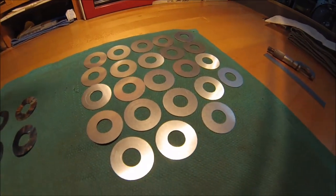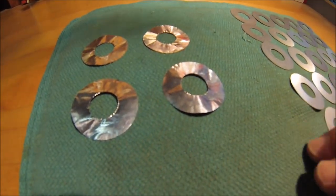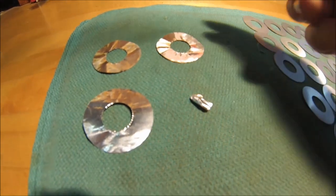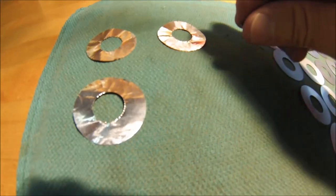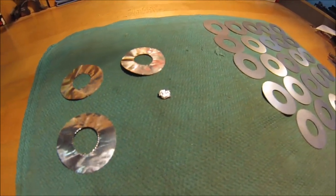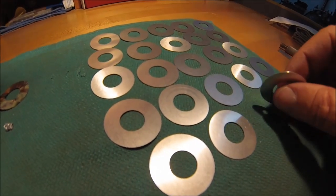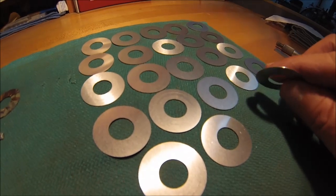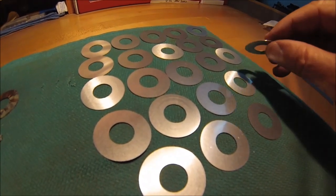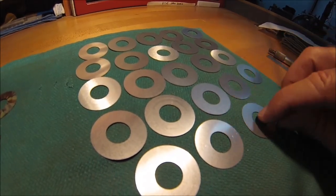Here is the yield: 23 washers, 8-thousandths of an inch thick. And the tin foil ones actually did survive, even though they got wrinkled up — you can stretch them out. This material is ridiculously delicate. To make a machined washer out of material that soft — that is not a bad trick. You can do this with plastic, steel, and naturally steel is going to require more patience and more pressure, but it can be done. It does yield a really nice part. Make sure the final pass you take is with a nice sharp tool, because you do not want the edges of the parts rolling over the part behind it — they will fuse and are very difficult to get apart, and when you try to get them apart chances are you're going to damage them. You need to make shims? Now you know how it's done.